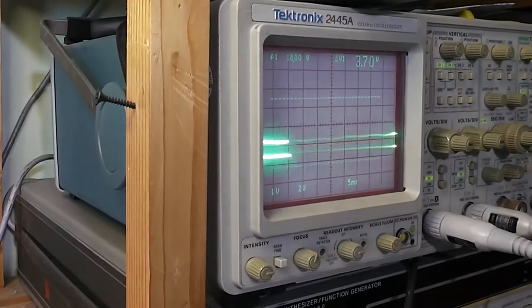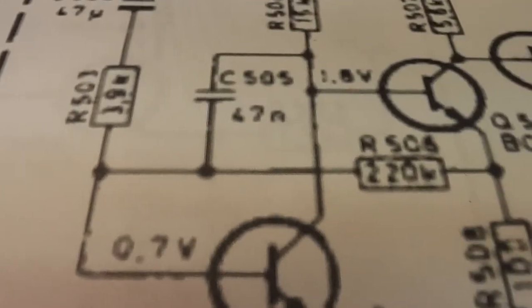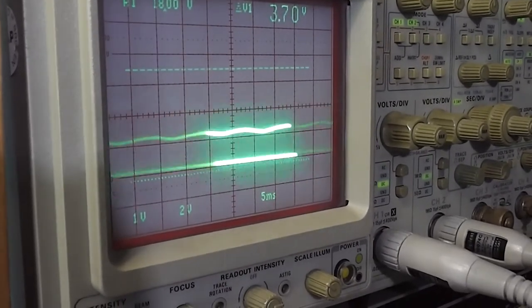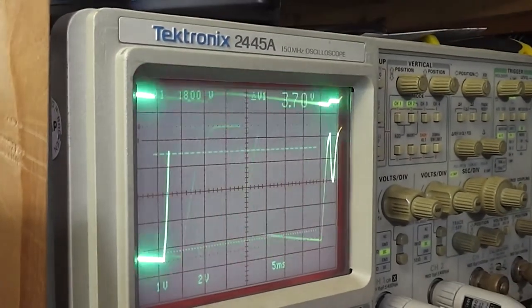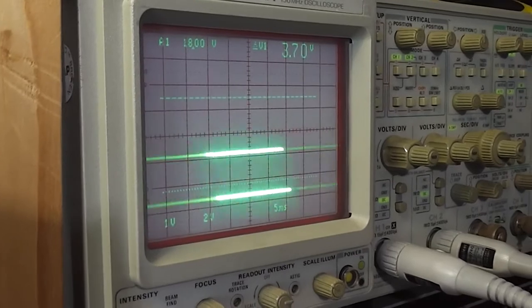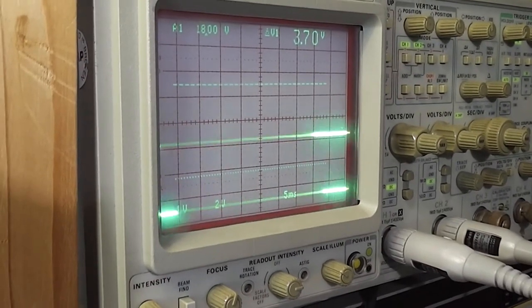Looking at what was done in the newer circuit modification, the feedback was changed which is at 220K, and there's a 3.9K input resistor. With the very low emitter resistor, the input impedance must be quite low, so I've reduced the input resistor from 3.9K down to 2.2K. It's a bit of a compromise but the voltage is staying a little bit higher now - not fantastic but it's made an improvement. The issue would always be that in fast forward and rewind it charges up so much it will take a while for autostop to kick in. They should have put a Zener diode across that capacitor to limit how far it charges and keep the timing more constant.